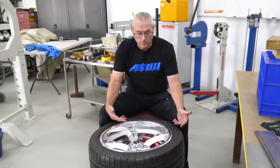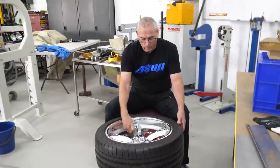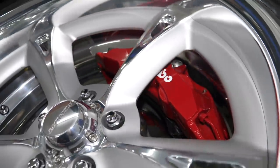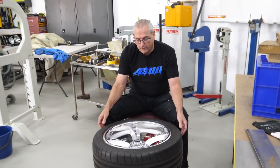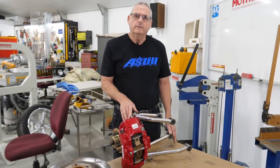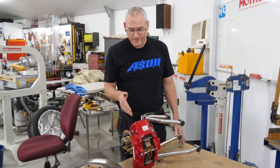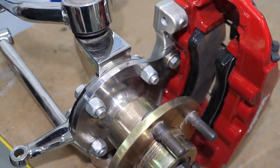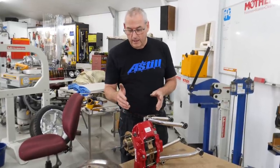After explaining how we've managed to get the brakes to fit, part of the issue was to clear the wheel. The wheel has got the right offset on the back to take the big brake - they're a six-spot, the same Brembo that's on the supercharged GT Falcons. The look of that classic five-spoke wheel in billet with that nice two-tone look with the full polish is going to be sensational. The front end in this car is a Rod Tech double wishbone - two wishbones, all nice and stainless - and it comes as a package. This particular one was bought without brakes, so we needed to mount the six-spot on there and one of the issues was getting the clearance needed in relation to the front end and the wheel.